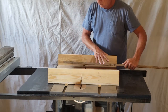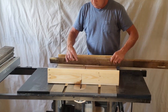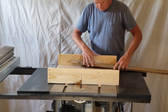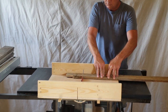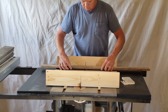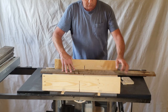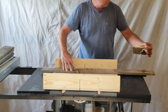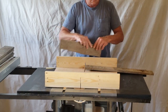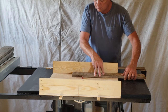Here's where I'm going to take each of the flats and look for the nail holes, and then any imperfection that I don't want close to the nail holes — I'll be cutting those off. This is not to get it to a final length; it's just basically a rough cut getting it down to what I'm going to be able to use. There are times where your boards won't have straight sides — as a matter of fact there may be a lot of times where they don't. You put the straightest one up against the fence and cut the nail holes all out, just move down the board. These off cuts will be used or can be used later, either in this project or in another one.